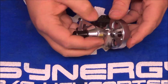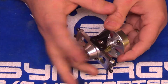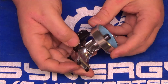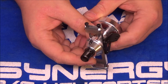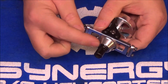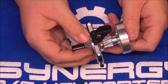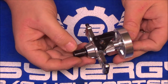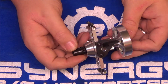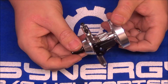Next we are going to talk about the clutch stack. There are a couple things in this clutch stack I want to talk about. I'm going to tear it down, show you how to change the pinion if you want to change the pinion, show you the bearings inside here. When we put it all back together we're going to Loctite the pinion on, Loctite these bolts holding the bearing caps on, and I'm going to use red Loctite on these set screws for the starter shaft. I don't like that to come apart. I'm a big fan of using red Loctite on things that can cause me to crash. While this coming off probably won't cause you to crash, it'll really ruin your day if you go to start your helicopter and this is missing or loose.